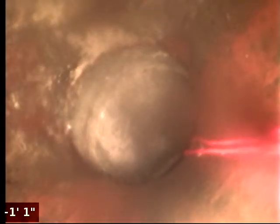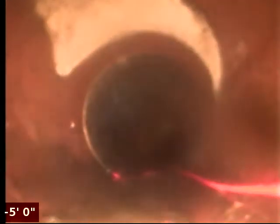Alright, we're going to keep recording here. I was able to get around that corner and we're all the way down to the city main line sewer now. This is running up and down 30th Northeast and a ways out there from where I'm recording this on the north side of the house. So I'm going to pull back from this city main. I got the footage zeroed out and we'll get a look at the entire line. So we're in a 6-inch clay line right now, coming back towards the clean out.